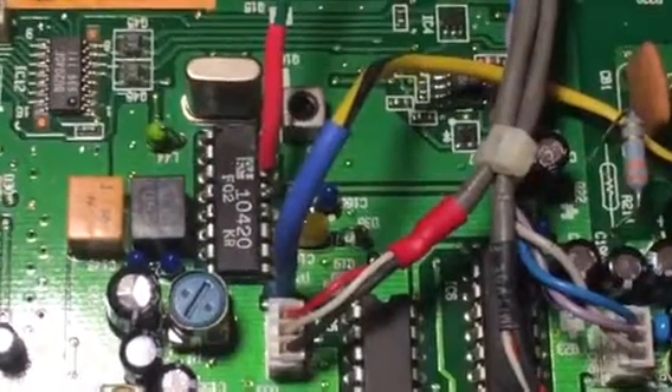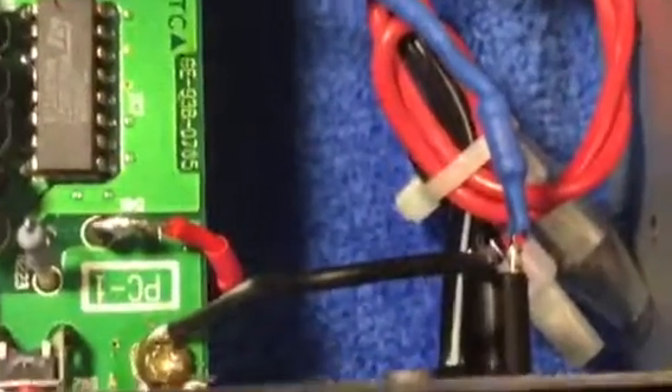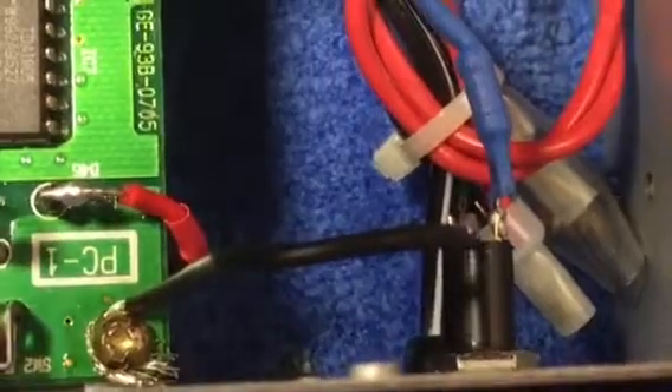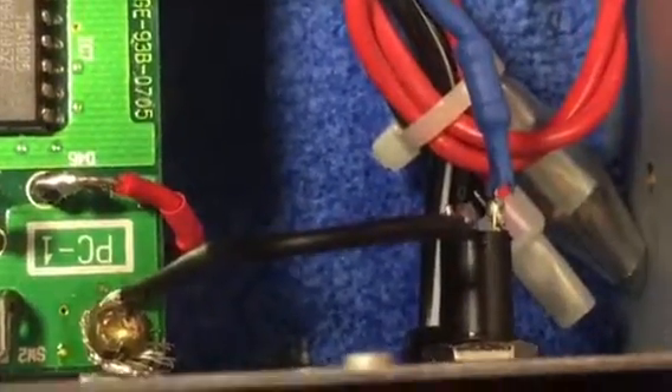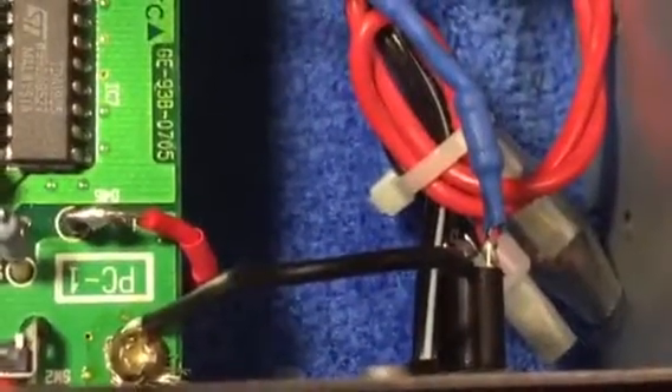Again, it's a simple mod to do. 10k ohm resistor hooked up to one side of the barrel connector here, follow that all the way out to TP2 or test point 2 next to the IC2 chip and tap into that. Once you've established your ground, unless you use a jack that is already attached to the chassis and already grounded by the mere attachment, then you don't need this wire that I've done. I chose this kind of barrel connector which is not attached to the frame or chassis of the scanner, so I decided to run a short jumper right into a ground point. So that's pretty much it.